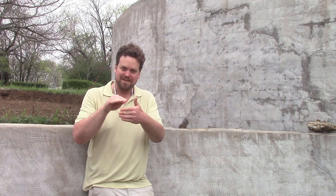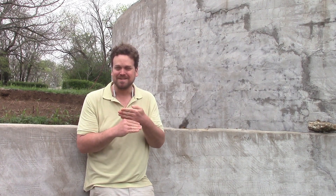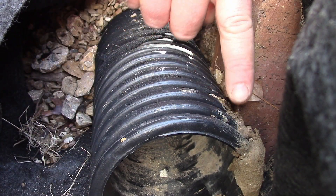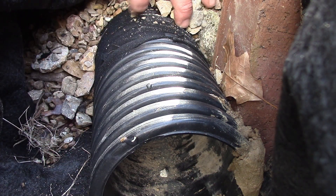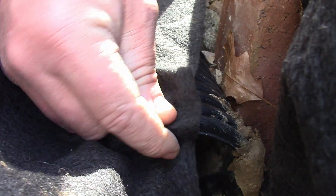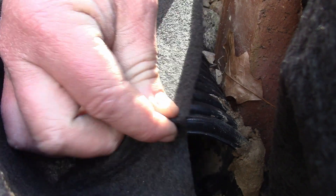There can be quite a bit of water transport underground and that's what we're hoping to deal with. We don't want the water level to go so high that our house is underneath the water level during the rainy season and we get intrusion of water into our living situation. What I've got is a drain pipe — a perforated three-slots-per-ridge double wall drain pipe — my gravel, and a non-woven geotextile filter fabric.